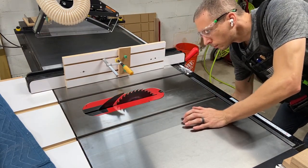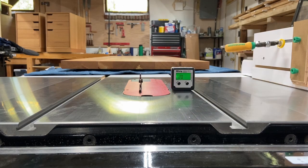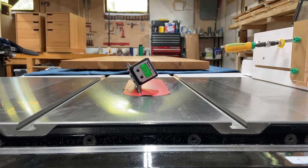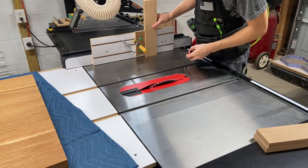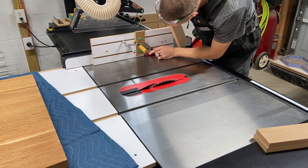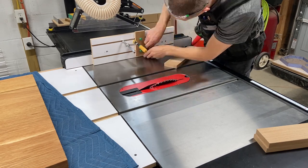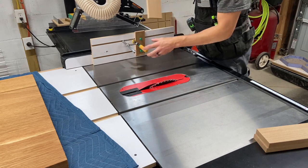Since I was very happy with the miters on the little test piece, I'm going to duplicate the exact process. I set my table saw blade to about 30 degrees. My digital gauge is reading upside down, showing 60, but either way I make sure my reference block is nice and square, get my pieces clamped in vertically, adjust my fence, and make all my cuts.